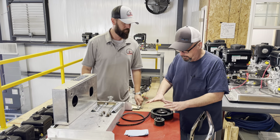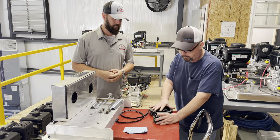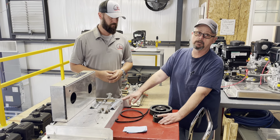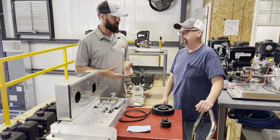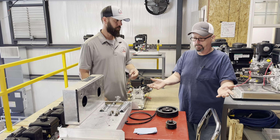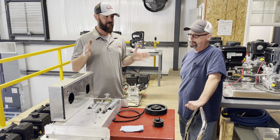This setup is designed to turn the pump at 1450 RPMs while the engine is running at 3400 to 3600 RPMs. The combination of these two pulleys is going to turn the pump at 1450 RPMs — hence the different sizes. On a direct drive, you're turning your pump at 3400 to 3600 RPM, whatever that shaft on the motor is spinning, because the pump is straight on there.